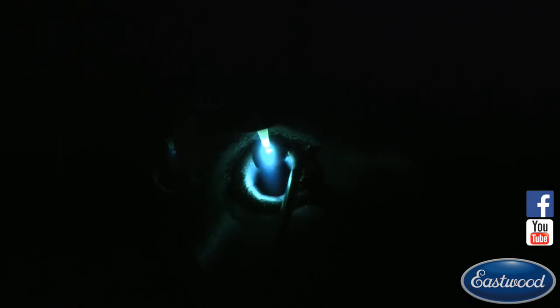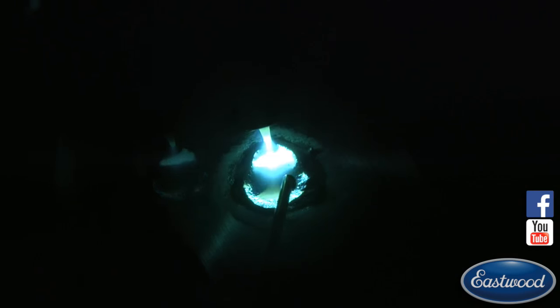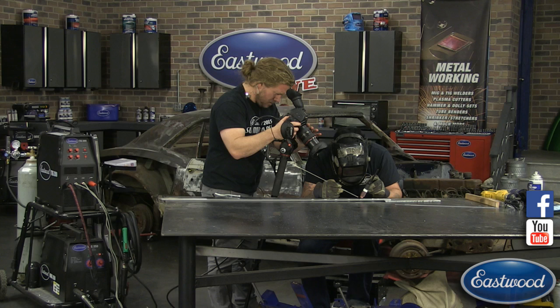Now that I got some heat into it, I don't have to actually... I'm going around, starting to fill up. Now when I get to where there's a hole like this, I'm going to punch the pedal. Start feeding filler rod. As soon as I see it fill up like that, I'm going to let off, blend the area in. I'm going to put one more last dab and come off real slow. I'm going to come to the side here, let off, let that gas flow. Okay.